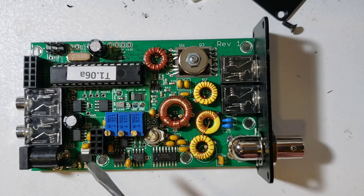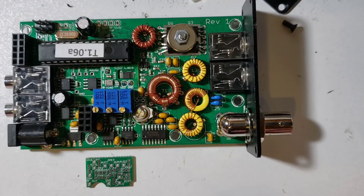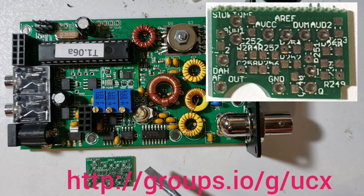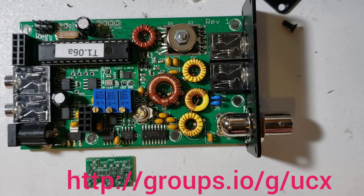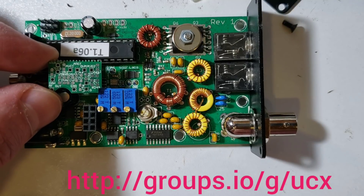There's an SMD 5-volt voltage regulator here, and you can see the three adjustments for the IQ balance and the low and high audio phase shift. All QCX Mini kits are supplied as standard with a daughter card PCB for the Micro SDX SSB transceiver modification. This modification is not supported by QRP Labs, but the PCB has been provided to make it easy to implement if you wish. There are certain zero-ohm resistors and a couple of wiring points and component changes, but almost all the changes are components installed on this daughter card PCB. It's designed to fit into this area of the main PCB.